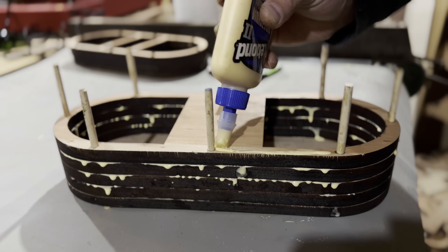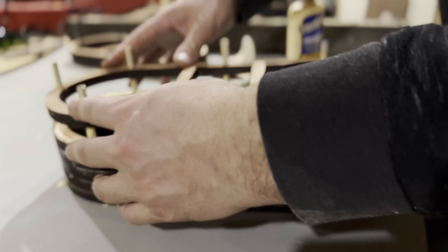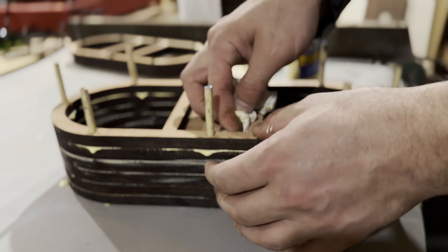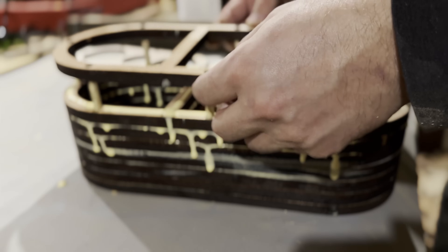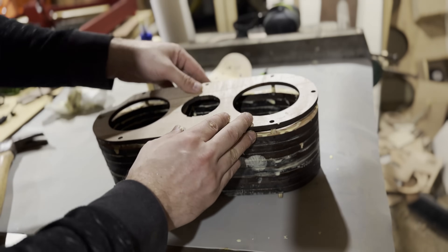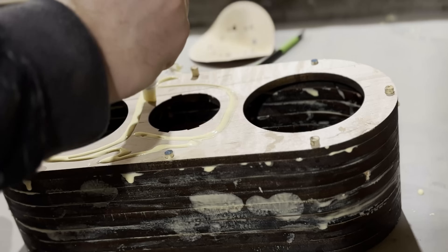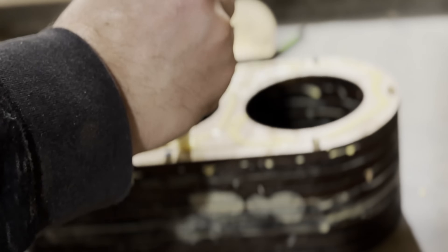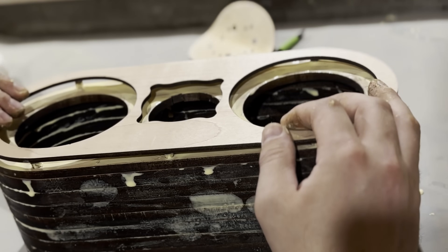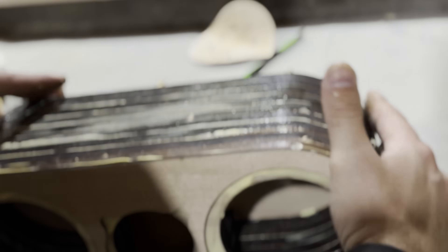One of the pieces is a solid flat back wall. That's because the BMR we're using for the high end isn't sealed — it needs its own sealed compartment, and that's what this is for. The holes worked out perfectly with the dowels to line everything up. I did go all the way through the rear of the speaker so the dowels could protrude out the back, meaning I didn't need perfectly sized dowels. The front baffle has laser-engraved dowel spots so it lines up perfectly, and it's the same thickness as the BMR so everything sits flush.